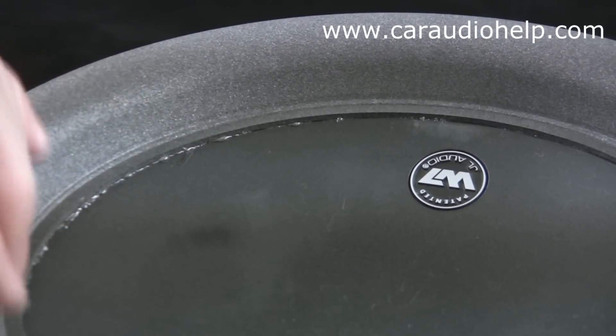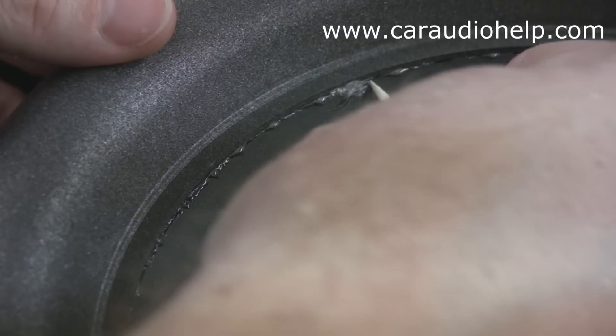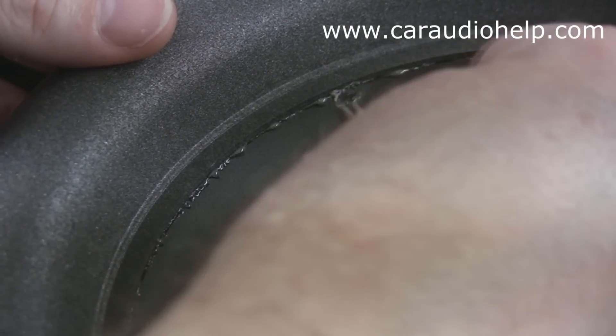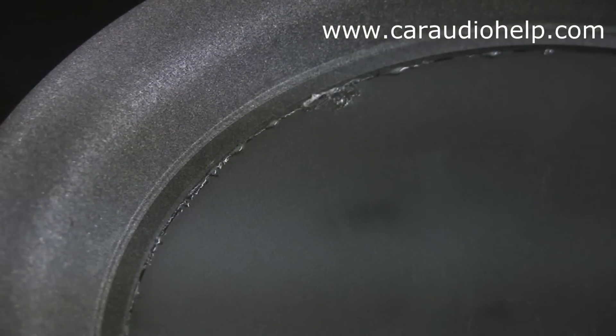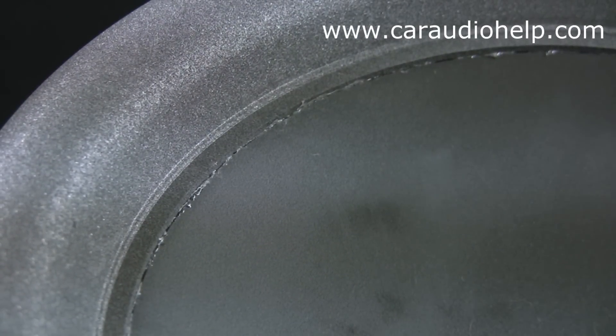After the glue has set you can put it aside and wait for the glue to fully dry. It should be cured within an hour but I always wait a full day before handling the subwoofer again. If you notice any excess glue has squished out, you can clean it up with a toothpick — put the toothpick into the glue and move it around to scrape it out. The glue should want to ball up, which makes it easier to remove. If it doesn't ball up, let it sit for a while longer; usually 30 to 60 minutes is about right.